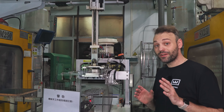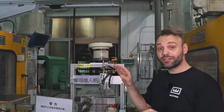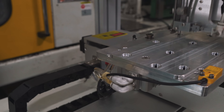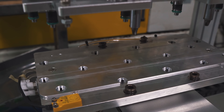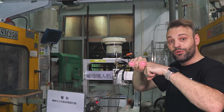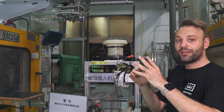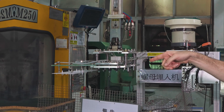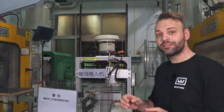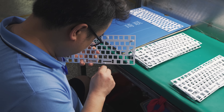Here we are at the switch plate. The switch plate is very interesting because it has nuts for the screws, and these already get inserted into the mold. This machine places the nuts in the right position so that the arm can pick them up and bring them to the mold, where pins inside the hole hold the nuts in place. The mold then closes, plastic is injected, and once done the suction arm grabs the plate and drops it into the tray. The nuts are placed into the mold beforehand because it's much more precise — ensuring the nut is centered so the PCB assembly is perfectly aligned.